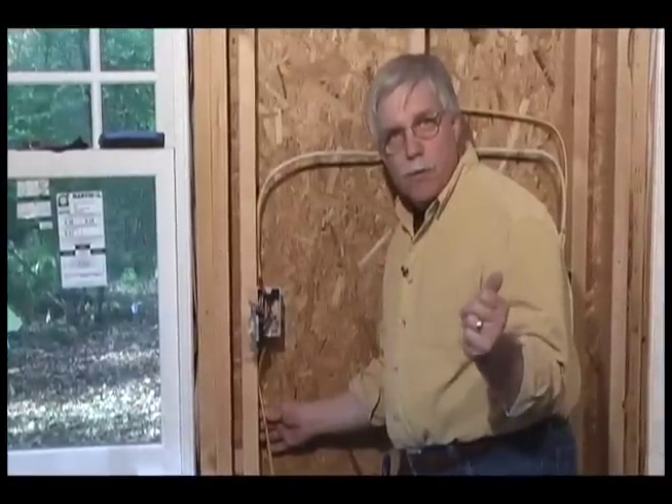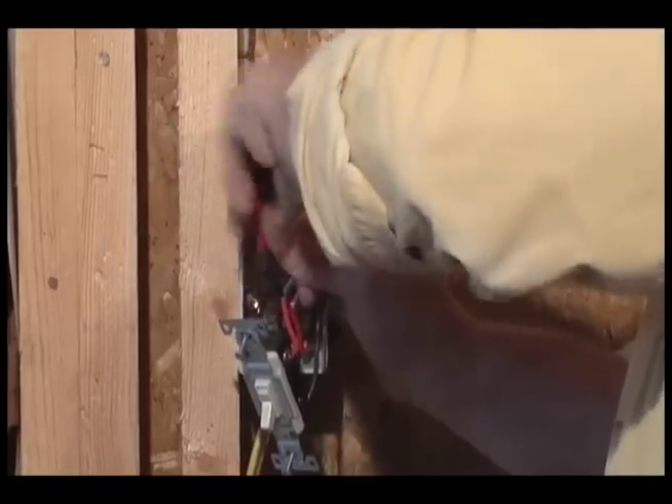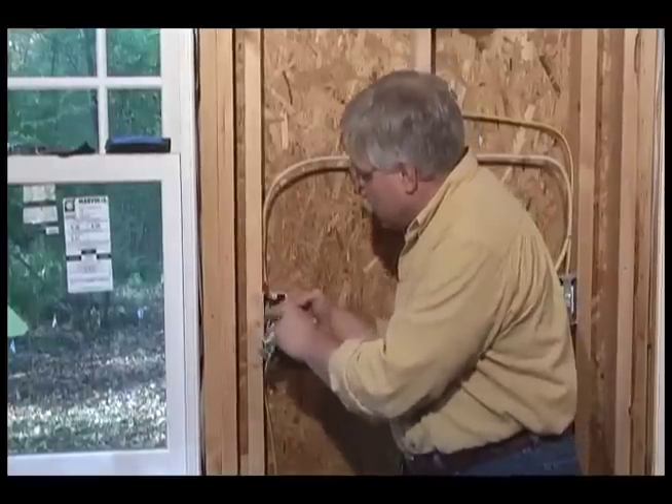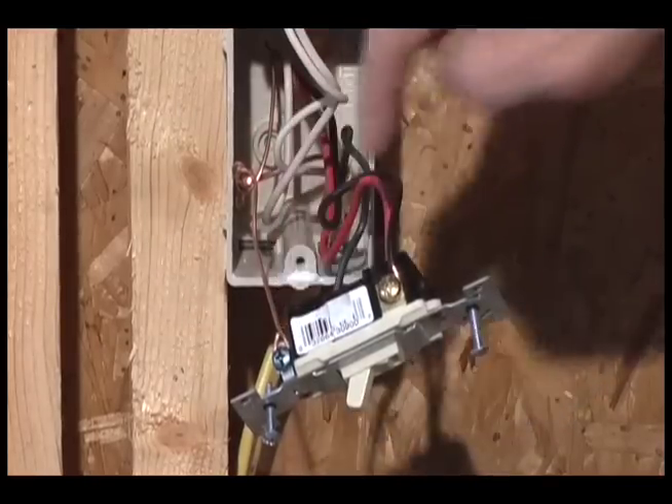Look at this jumble of wires in here. I know you're confused, but look how simple this really is. Remember, this yellow wire has a black wire which is the hot, coming from your service panel. It has a white neutral wire and the bare copper ground. This white wire had those same three wires plus a red wire. The white neutral wires just get wire-nutted together, because that's sending the neutral directly up to the light bulb. The ground wires are twisted together, and one attaches to the ground screw on the three-way switch.